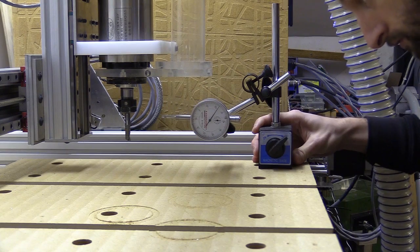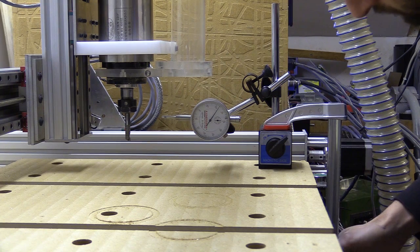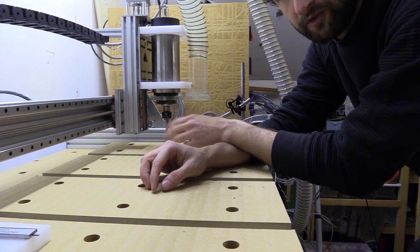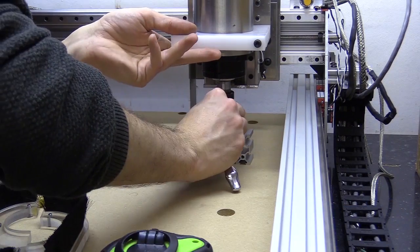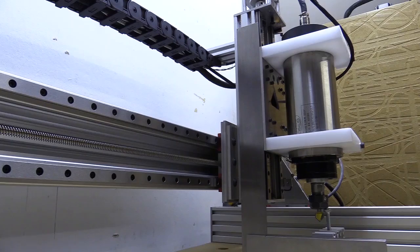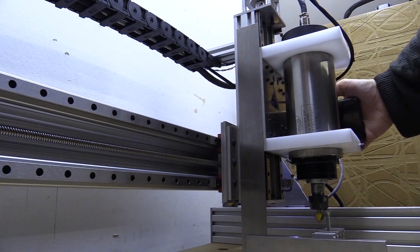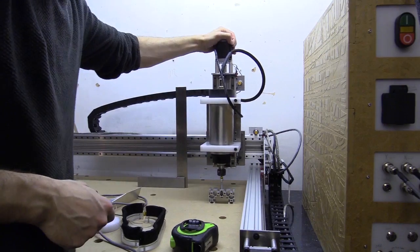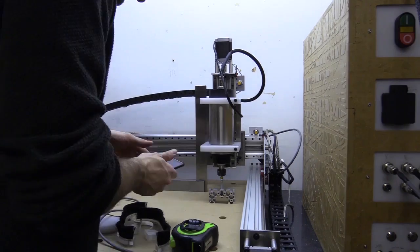In this video I'm going to check the flexibility of my spindle and do any final adjustments to the steps of the x, y, and z axis. I've already squared the x axis to the y axis as best I can, trammed the spindle using the pivot plate method, surfaced the wasteboard, and finally checked the tram of the spindle by measuring the bit's squareness against the wasteboard.